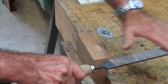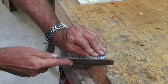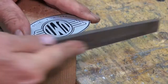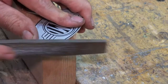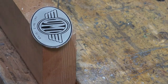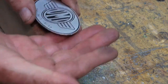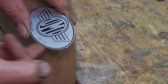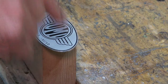If you hold it back here you've got a lot of overhang and it's very hard to keep the pressure on the teeth of the file to make the cut. I'm just going to hold this down and work my way around, slowly taking off the excess. That's close to where I want it — just eyeballing these edges. This is going to be fitted against another piece of aluminium of around about the same age, so if I misjudge the width of that outer edge it's not really going to show that badly. I'll give that a light sand with a sanding block to remove the burrs and drill some fixing holes.